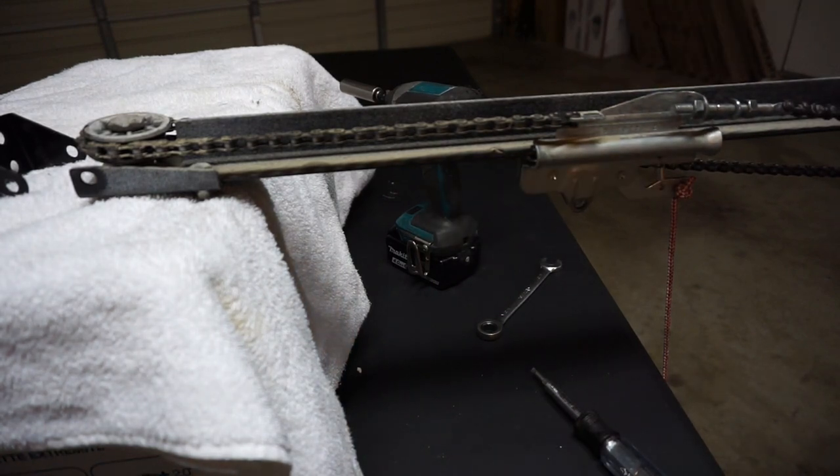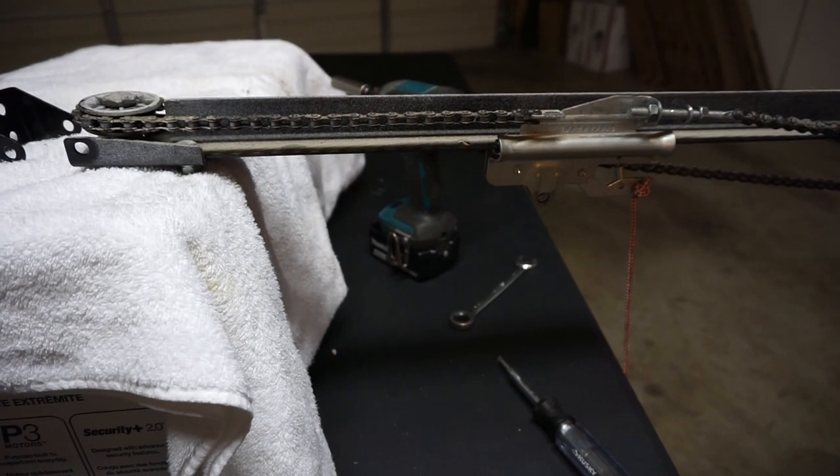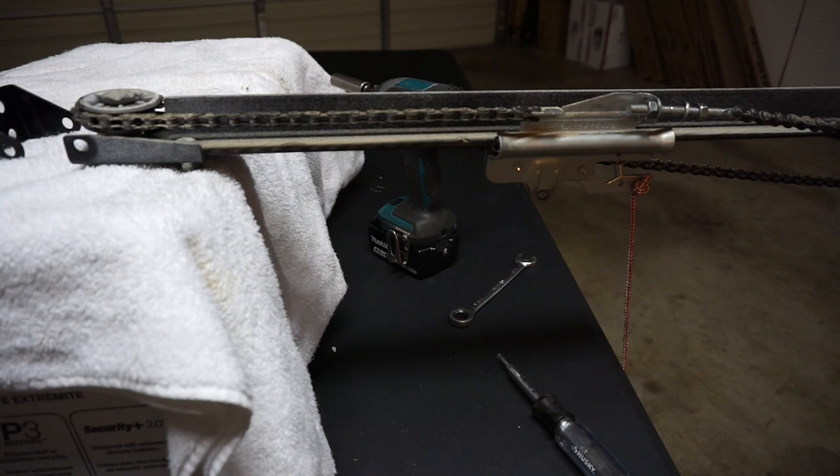This trolley piece can be ordered on Amazon — I'll include a link to that for you. The exact same process works for a belt-driven one, literally the same thing, just a slightly different configuration but the same concept. This is typically on a LiftMaster — you'll also see this on a Craftsman, AccessMaster, and Chamberlain, and it's about the same process for all. I've actually even used a chain drive trolley on a belt drive and vice versa, so the trolley piece itself is the same. I'll include a link in the description.